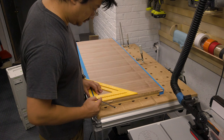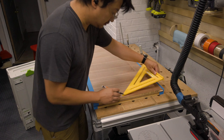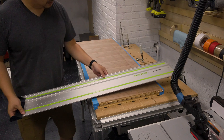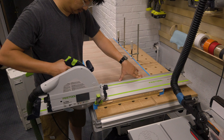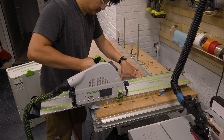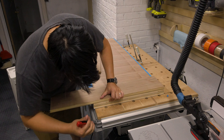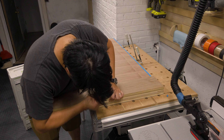For the ends, I put both the top and bottom pieces together and lined up the sides, marking a square edge where I'm going to trim both edges off at the same time. This way I know I have the exact width and that they're both equally square together. So even if the top isn't perfectly square, the sides will be exactly the same so when I put in the walls on the left and right they'll be square to each other.